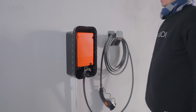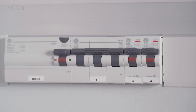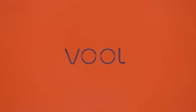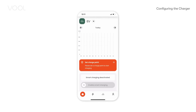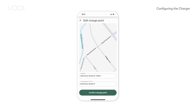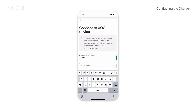Slide up and snap on. Now you can switch on the power as well as the RCD protector. The blinking green light indicates the power is on and that the charger is ready for setup. You are ready to continue the installation on the VOL app. Go to your profile, turn on the installer mode, and start a new installation or choose an existing one.